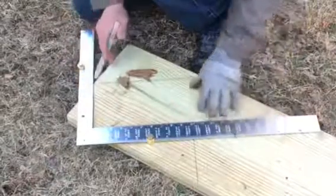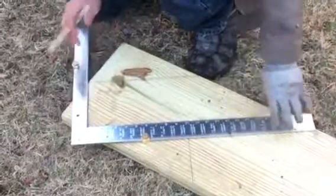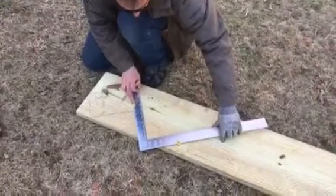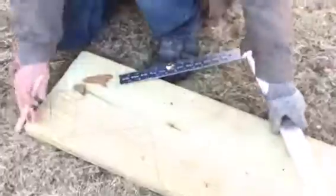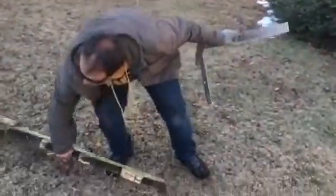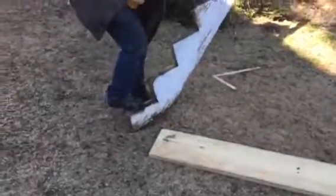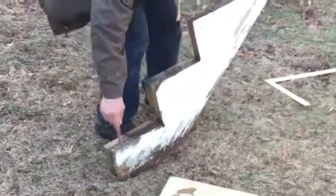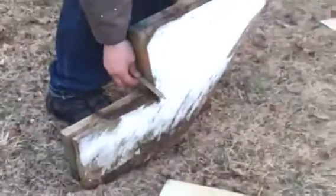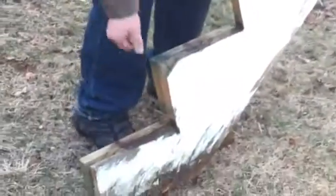The important thing is these first ones are making six inches tall — well, five and seven-eighths, whatever. All the rest of them are gonna be six and seven-eighths. The reason being is when you step up here, your foot's gonna step. If you look at this stringer, you're gonna have your foot standing right here. Well, when you step up, you got wood on top of this, about an inch taller. So this first step has to be one inch shorter than all the rest of the steps. Because the decking board's gonna bring it up one inch — that makes this one inch shorter. But you got another decking board, so that brings it up an inch. So the very first step has to be one inch shorter than all the rest.